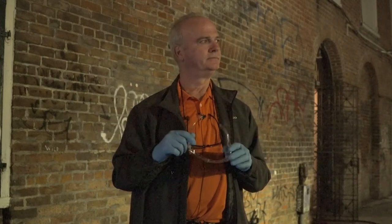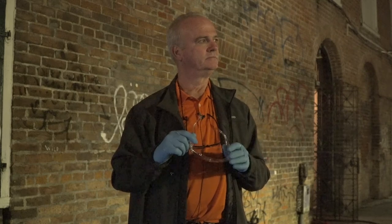Do you know if that's similar to a product called water glass? Are you familiar with that product? No, I've not seen that one. That's Limeworks. I think it's lithium silicate. Yeah, those silicate products are the same products they use for concrete densifying, and there's silicates in some of our products for external conservation, but those things have a terrible smell, and the smell lingers, and they're really not holding sand together like this one.